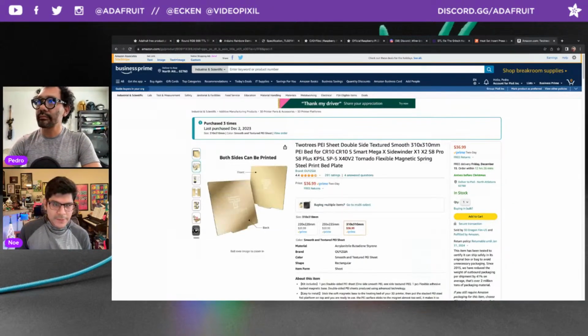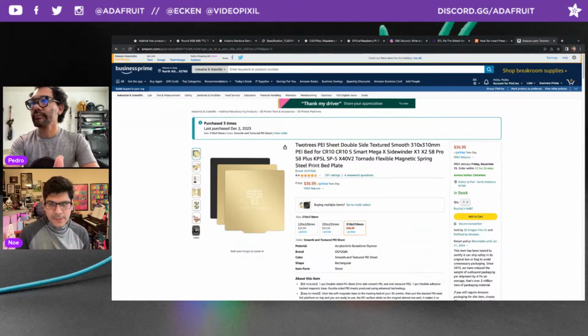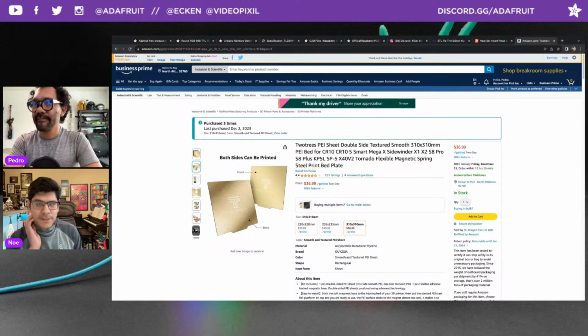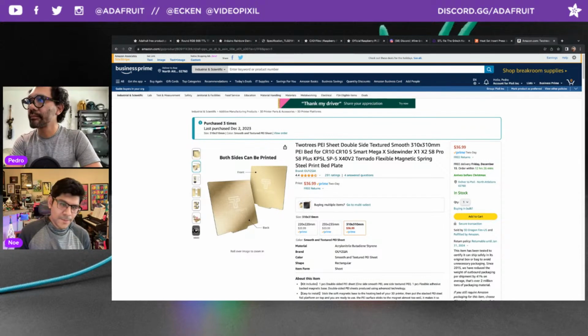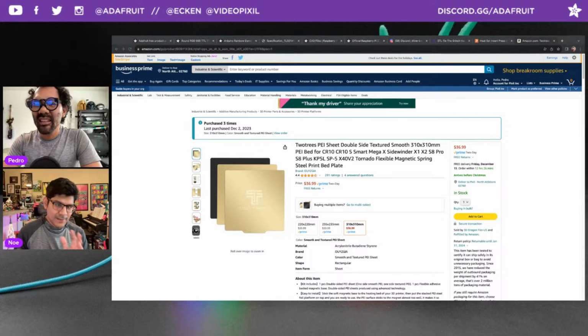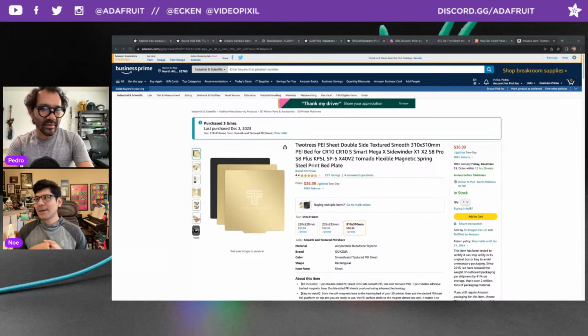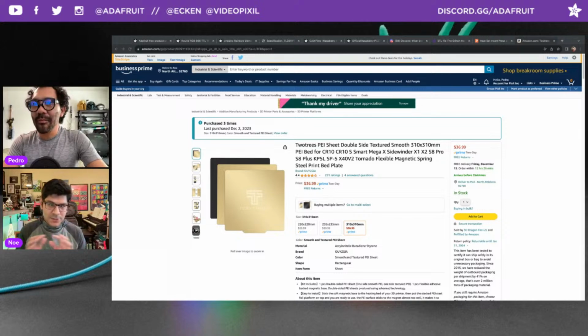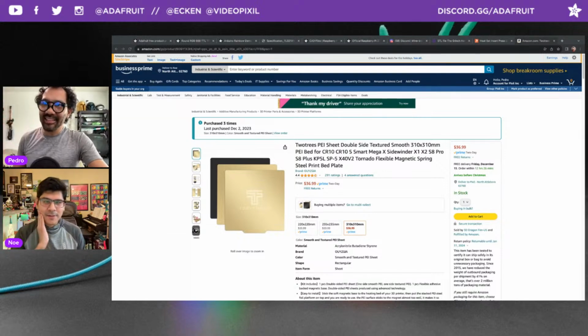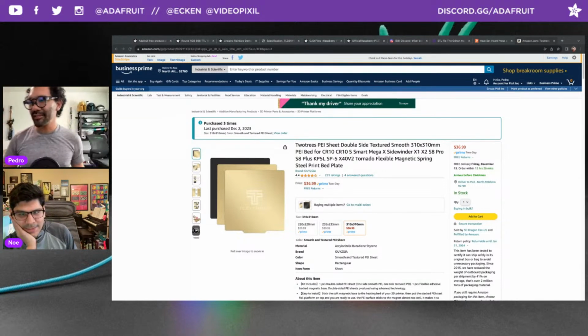If you have a 3D printer and you're looking to get a better bed, I definitely recommend getting this style of double-sided PEI sheets. I got an S1 Plus from Creality. It's like the Ender 3 series, and it came with a bed that was that build tack material. It sticks too well, and it leaves blemishes on my prints. Even with the nozzle far away, it's crazy how stuck it gets.